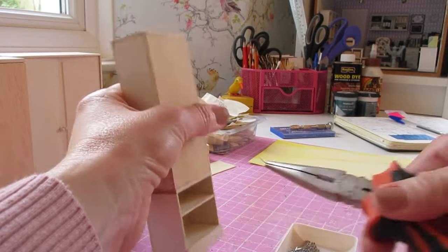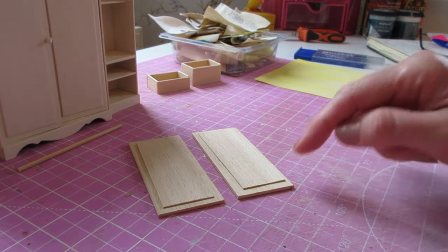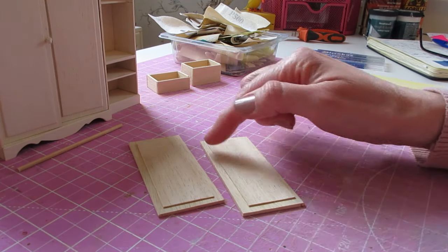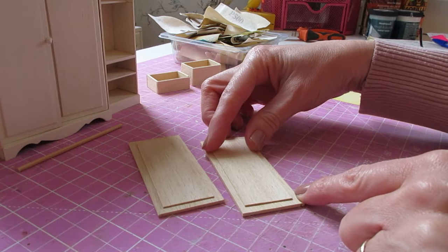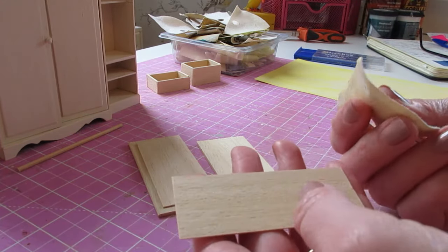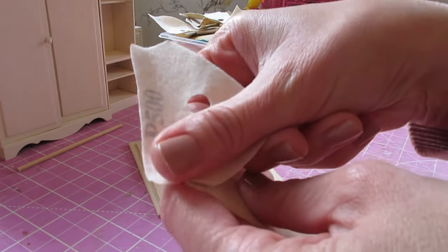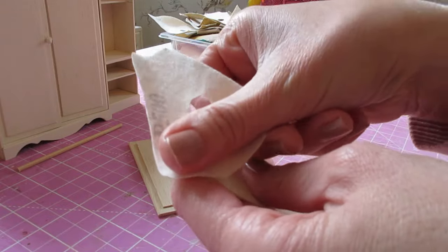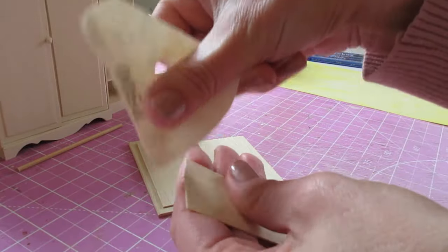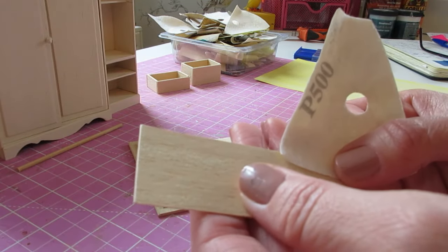Do the same with your remaining door. Once you've drilled the holes in the doors, go ahead and cut the pieces needed for the moldings — I size those by leaving a 5 millimeter border around the outside edge. We're then going to bevel them off in our hand, just because we're working with such a thin piece of wood. Support it as much as you can with your fingers and then just sweep your sandpaper along at a 45-degree angle — we're just getting rid of those sharp edges.